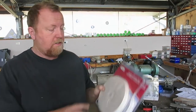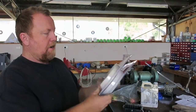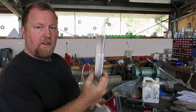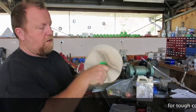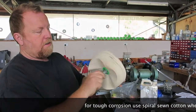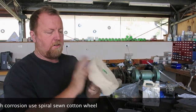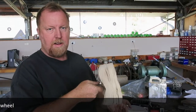What we're going to use to polish is some large 200mm buffing wheels. They're for bench grinders, so they're a little bit thin. To get around that, we bolt two of them together — a bolt through there joining two mops — so you've got loose cotton cloth, and then we're going to put buffing compound on those and use them in a drill to buff the surface of the metal using cutting compounds.